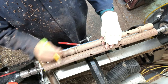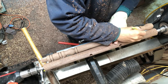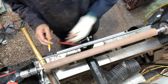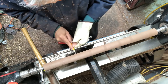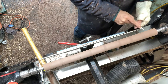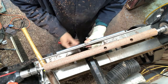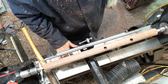Make these little tick marks pretty thick and then you can turn on the lathe and make that line go all the way around. Try to get as close to your cut points as possible. I'm just using the pencil to get the line all the way around the leg. These layout lines are a very important part of the strategy to make a duplicate — whether it's a baseball bat, stair balusters, stool legs, or chair legs.